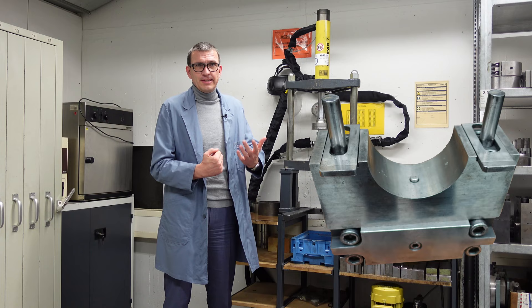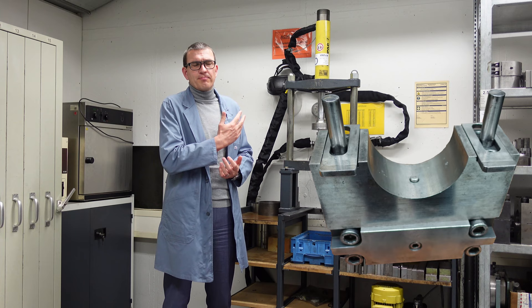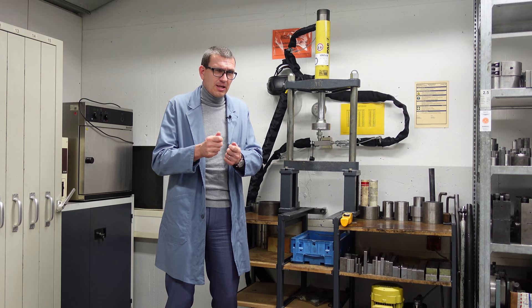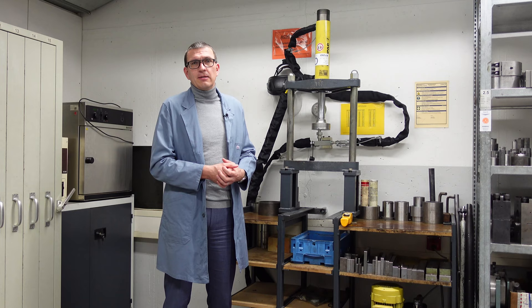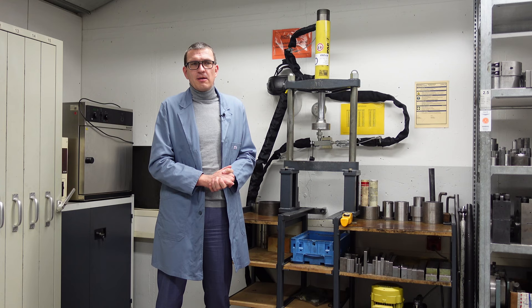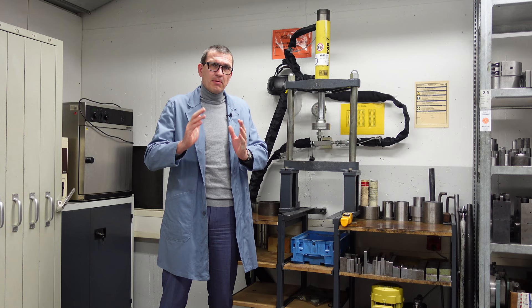As long as the metal parts are still movable, the housing is not completely closed, so we need to push it a little bit further. That's a little bit tricky and we move in very, very small steps. With the experience of the engineers, we know exactly how to do that and figure out the clamping force. For mass production, you normally do not use a press to install a dual bush — you tighten the four screws very well balanced in order to avoid any misalignment of the housing.